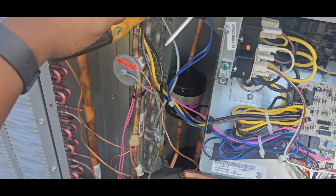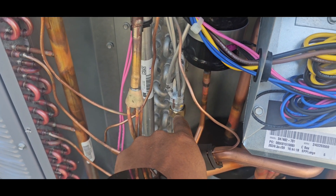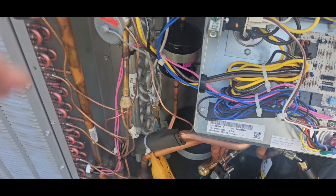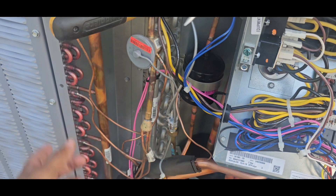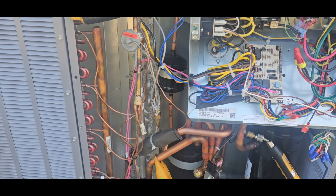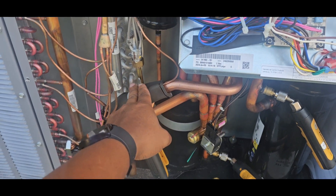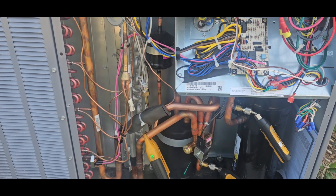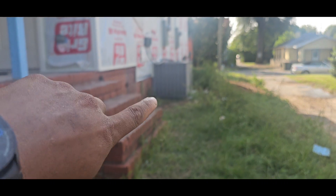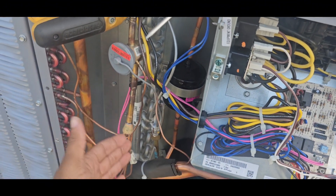This unit uses superheat for cooling because this is the evaporator coil right here — that's the piston attached to it. It uses the TXV for heat mode, so when it has to run in heat mode, that TXV is the metering device. On the split systems I normally work on, the outdoor condensing unit uses a piston and you'll have the TXV at the evap coil. So it's interesting why they switched for the package units. It threw me off when figuring out the charge — I was thinking sub-cool because it's a Tempstar, but then I saw the TXV and then I looked closer and saw there's also a piston.